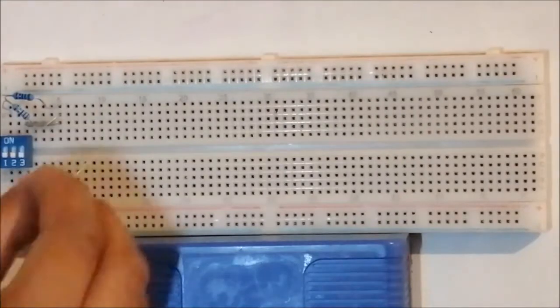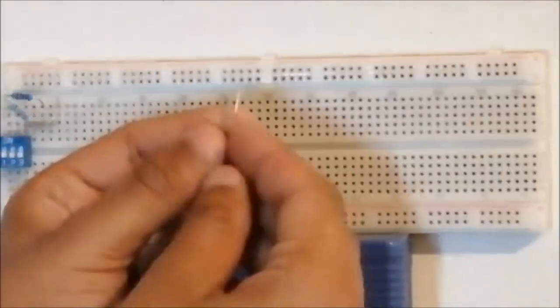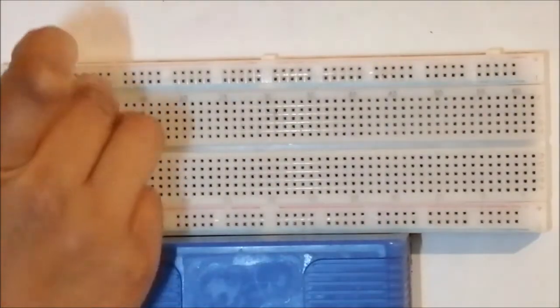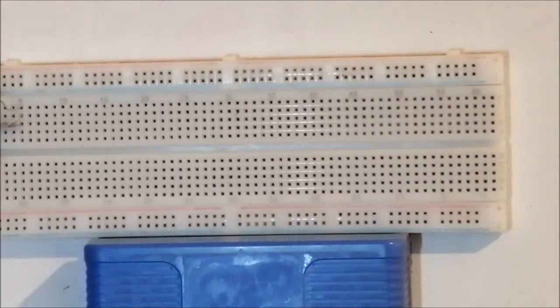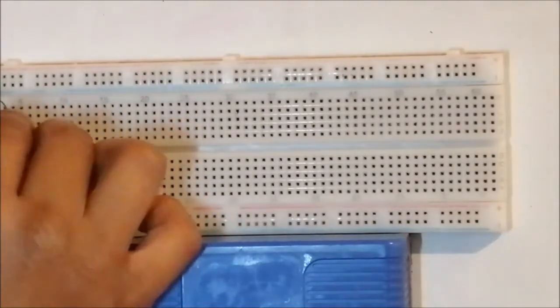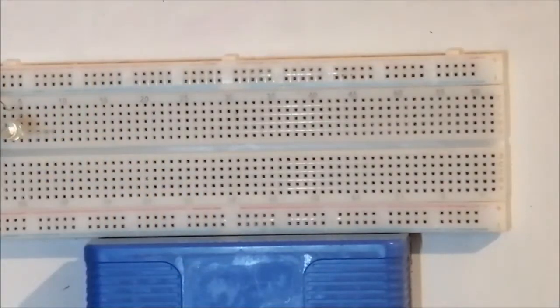And now the LED. You put the LED, the minus side here. You check like this. The longer side is the plus side. The shorter side is the minus side. You put the minus side in line with number 5, where everything was. And then put the plus on the other side, like this. And leave a light hole open there by the plus.